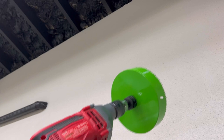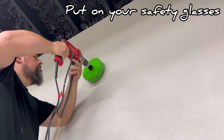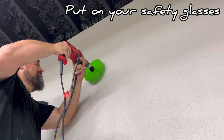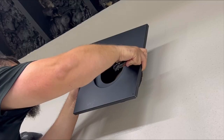I've got it chucked up to a heavy duty drill. This first layer we're going through is sheetrock, so be careful — once you've drilled your sheetrock out, stop and pull the insulation out so you are ready to go to the next layer, which is the outside wall. I'm going to take this nice and slow. You can see it torques really hard if you get the angle off — you've got to take it easy. It never hurts to test-fit your thimble after you drill your hole to see if it fits. It looks like this one will with just a little bit of extra trimming.